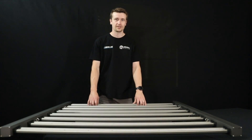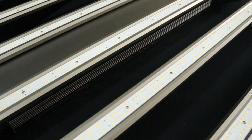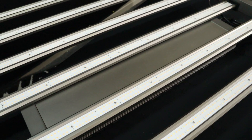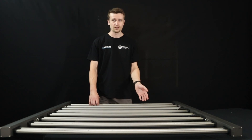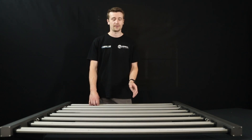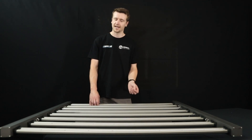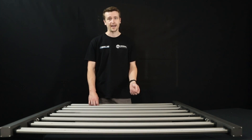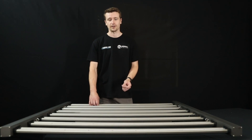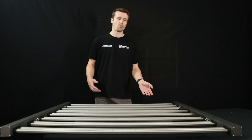Moving on to the diodes across this panel — we've got just over 2,000 Samsung LM301B diodes. They've kept the same excellent formula, built up of 3,000K and 5,000K diodes. There are also Osram diodes supplementing the 660nm reds and a bit of 730nm far red. It's worth noting that these panels have seen an 8% increase in far red to trigger more of an Emerson effect. The idea is to get just the right amount of far red — too much and you'll see stretch in your plants; get it just right, which we believe they have, and you'll see a much better fruiting or flowering cycle. When combining the 3,000K and 5,000K diodes plus the 660nm and 730nm, we saw about a 3,500K average CCT emitting from this panel — pretty much spot on where we and our customers want to see it.